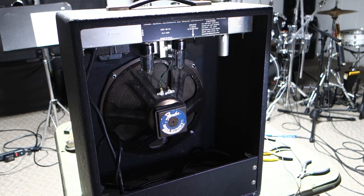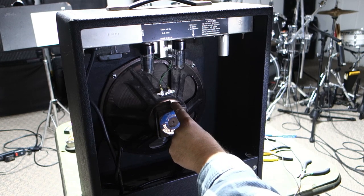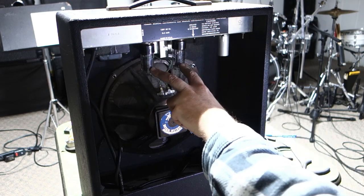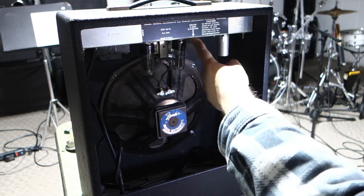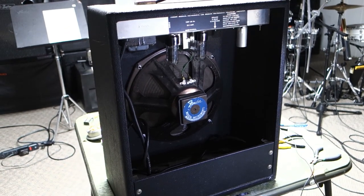Boys and girls, DK, Mr. V Amps — we have something kind of interesting here. This is the back view of a Fender Music Master Bass. It's a small, sort of practice bass amp from 1975 based on the speaker date code. That is a CTS-made speaker. It's got a 12AX7 and two 6V6s, and the speaker is supposed to be 8 ohms, 12 watts — so a practice bass amp. That's something you don't see every day, and we'll give it a flip around here.